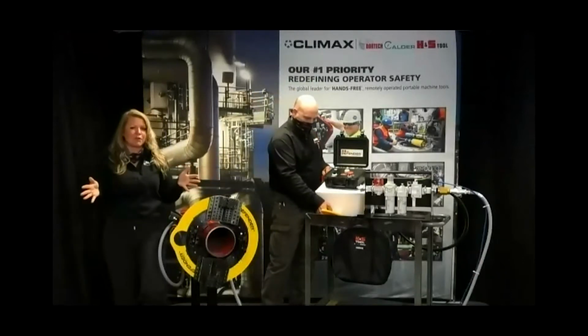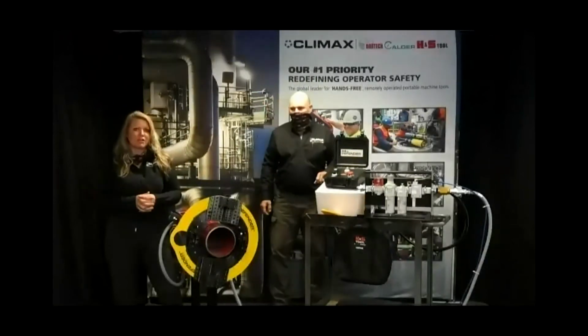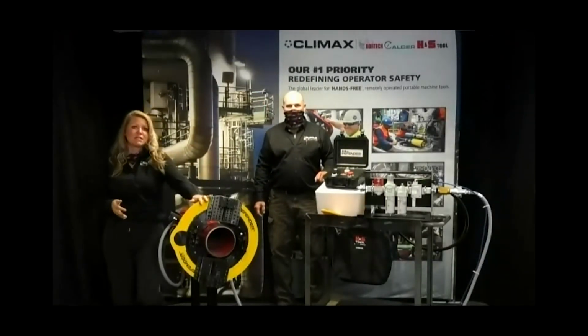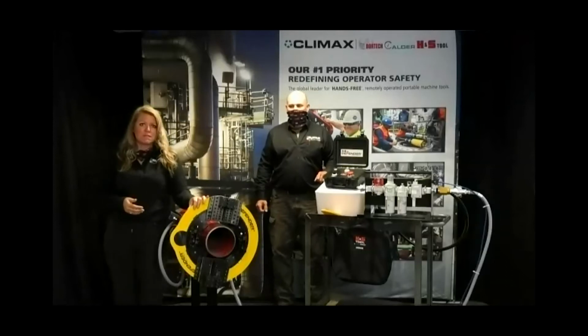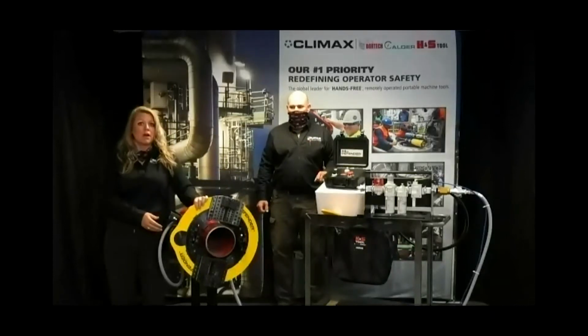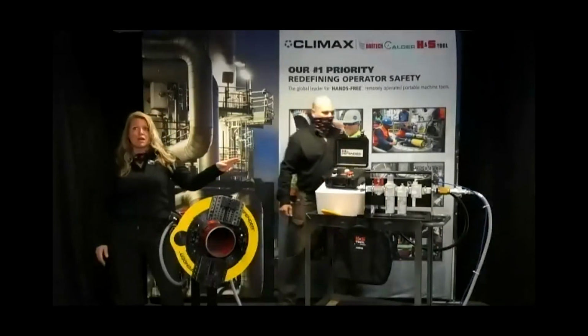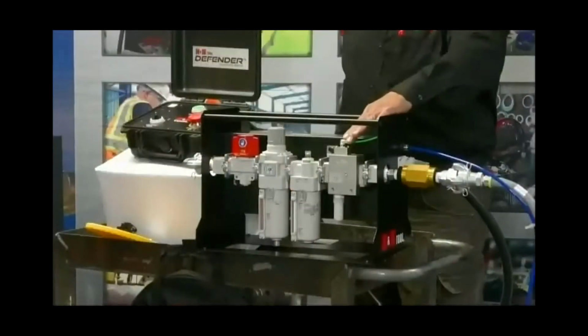So it kind of acts like a bumper if you think about it, and you'll see that shortly here in the video or the clip. So this design mitigates pinch points from the motor and from the tripper when the tool slides are rotating around the clamshell. So this is a low profile guard, so you should have little to no disruption from standard operation.